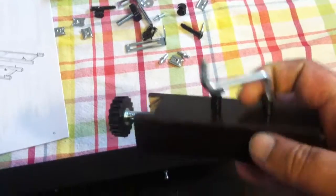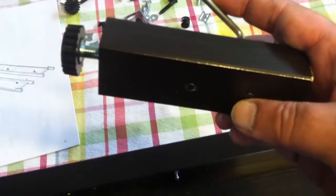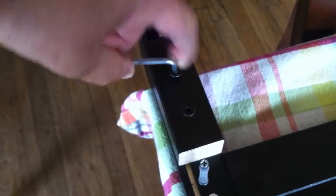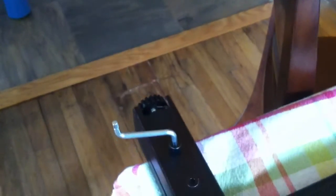But if you're doing a whole bunch of stuff, yeah, you need to go get the hex adapter for your impact. The other thing I'll do is I'll screw this in so that these are ready to contact the other holes before I get it in. Otherwise, when I go to screw it in, it's kind of like pushing one away from the other. One of these already tight, you can speed do this if you're not trying to hold a camera with one hand. We just tighten that down and it's good to go. The other thing about doing it by hand is you run no chance of stripping it out, because it's actually threading into a relatively thin part of the material this is made out of.